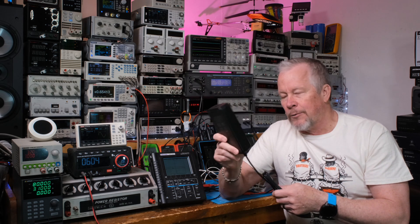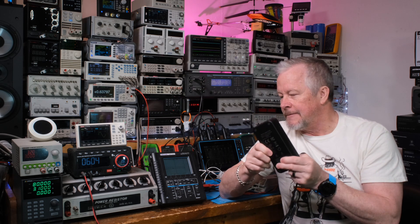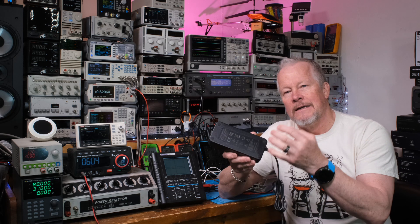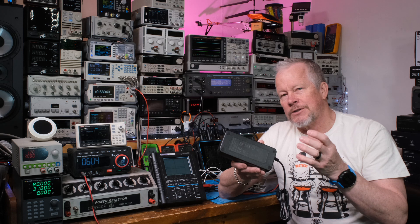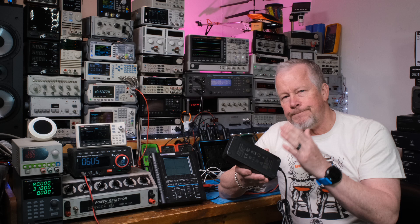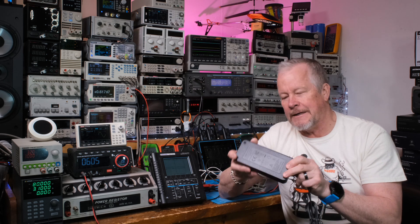We've seen how well we're measuring THD up here and we're doing a good job. This thing doesn't really change between low power and high power, so it's probably pretty clean. So let's check the power factor to see how good it is and how efficient it is. That's another giveaway — the traditional power supply is not as efficient. Those pulsating DC currents and the low-frequency switcher cause high current spikes going through the diode with a 0.7-volt drop. Even Schottky diodes are around 0.5 volts — still less than silicon but they can still dissipate some energy. Active power factor correction can be more efficient, up in the nineties. Let's come over and take a quick measurement.